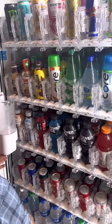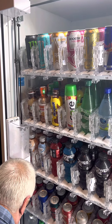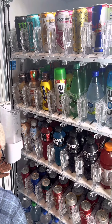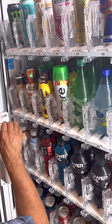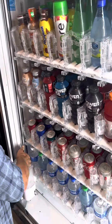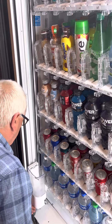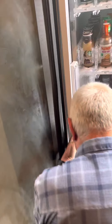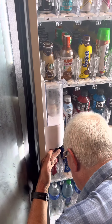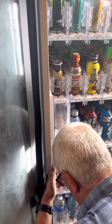This machine will be homing, randomly works right, but we walk away and it comes up with the same error again — random errors. There's a relay switch they were going to adjust. Brian here is adjusting the vertical shaft of the cup to make sure that the top and bottom touch the home position at the same time and same place, because it's currently not doing that.